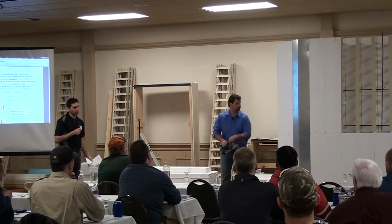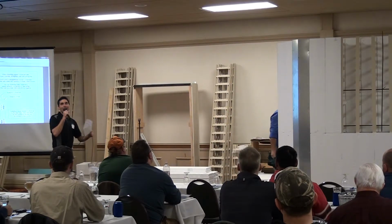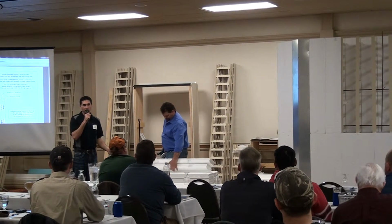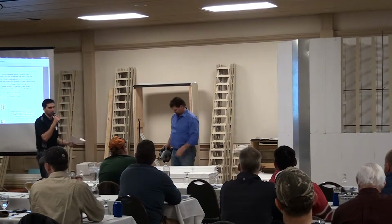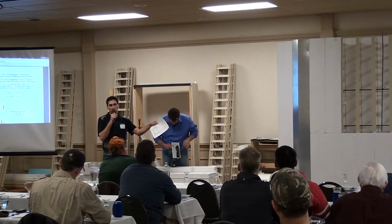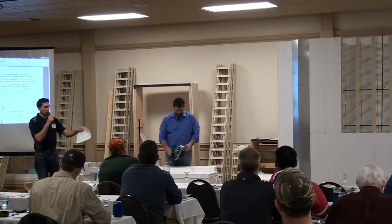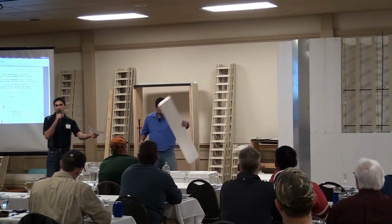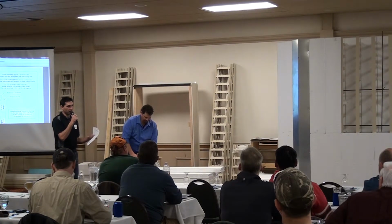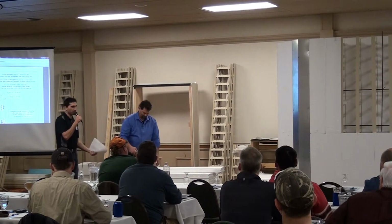You push that metal 45 or? We certainly can. It's not necessarily needed. There's a lot of things when you build with just about anything, but especially with ICFs, a lot of things that can speed the process or make it easier and better, and that's just one of them. We could have a wood brace there instead, just cut a couple 2x6s on a 45 and screw those together and put it on. But with this metal corner, when you build it on the ground and then stand it up like Jerry just did there, instead of building it in place, that just helps out a lot, and it keeps everything nice and plumb and true. And when I wrap around with a brace to hold everything plumb, it's nice to screw to. So we certainly can provide it.